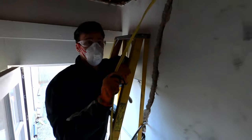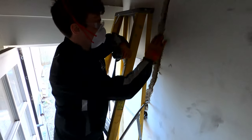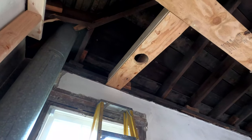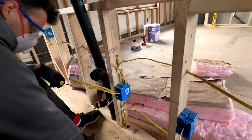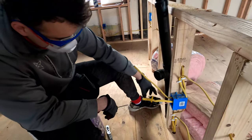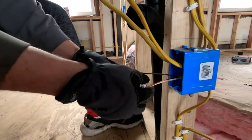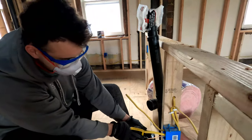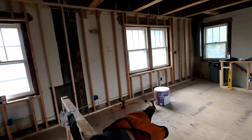We're trying to run our three-way wire so you can turn the switch on down here and off up there, and vice versa. We had to chisel out all this old plaster and old conduit to run our new wire — the homeowner wants a light right at the top of the steps. Chris is going around putting in all the outlets and boxes. A little thing about GFIs: there's always a yellow sticker on the bottom — that's your load terminal. The top says 'line,' which is always your power coming in from the panel. We'll take the sticker off and run the other wires into the load.